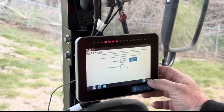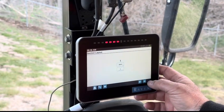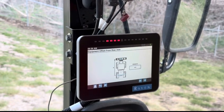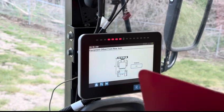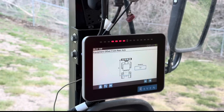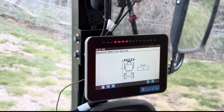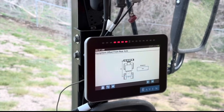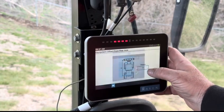So now we're going to go through that. 264 inches. These distances are in our book written down. That distance is not in the book. That is the set distance for your slinger in front of the rear axle, and we are defaulting that to 108 inches on every unit. We will get a sticker put on the units to tell us that.